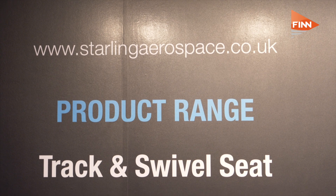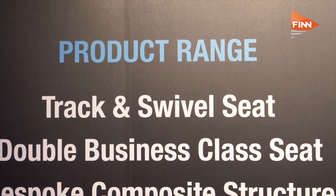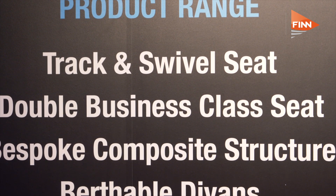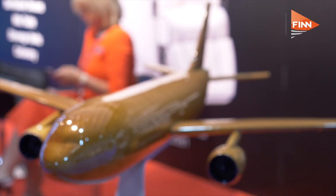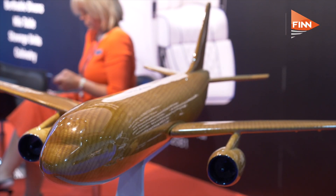The film is laid on the surface of the water and then dispersed with a spray. Then you have the photograph only, floating on the water — you can actually see the water rippling — and then you pass the product through it and it wraps around the product and you have that finish. You can use it anywhere you would have used veneer in the past, and on any shape. Veneer would only work on a flat surface, but this can wrap around any kind of surface — that's the versatility of it.